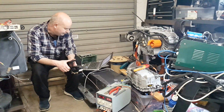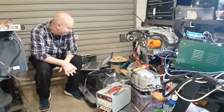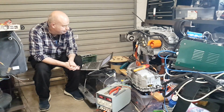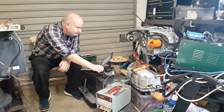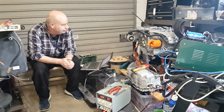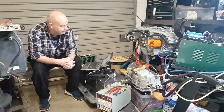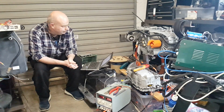So I don't know. It doesn't look to me like we have a signal integrity problem. That's the main point here. I think there's probably something else going on. As I say, I can pulse it a little bit, and I suspect knowing some more of the parameters about the motor, particularly the pole count versus the resolver pole count, is going to be what we need to do.